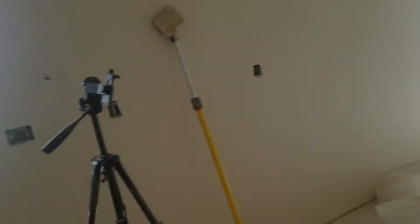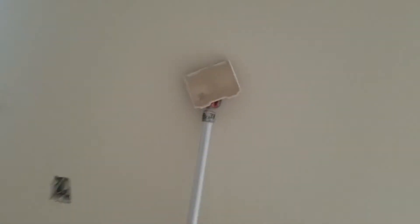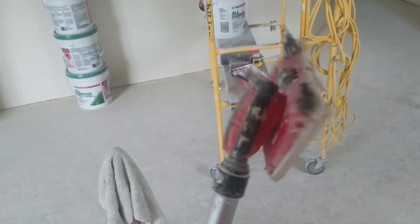I'm not going to try to get that any heavier — that last eighth to a quarter inch in that ceiling-wall joint. So that's the tool we use. You can get these at Ace Hardware, probably around three or four bucks. You can get replacement pads. When you load these, don't go down deep into the paint or you're going to get paint all over the edges where you don't want it and can't afford it.